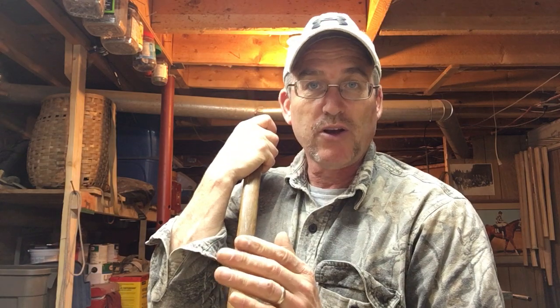What's happened is your handle wood has gotten quite small from the shrinking and swelling and shrinking. So if it's at the small point and you wedge it with a wooden wedge at that point, it's going to hold really well — likely for the rest of the life of your axe handle. So the thing to do at that point is to re-wedge it. That saves putting all this metal in, because eventually you've got to take that out if you want to replace the handle. When you start drilling and you hit another piece of metal, like I just did, I broke two drill bits — that's what happens. So re-wedge it: grab a new wedge, pop the old one out, put the new one in, drive it in nice and tight, and you shouldn't have any more problem.